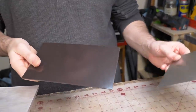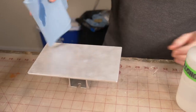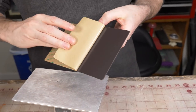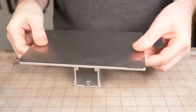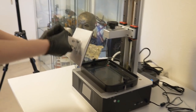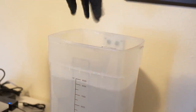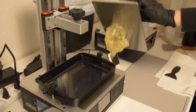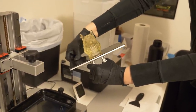To make our printing more streamlined with the resin printer, we picked up a flexible build plate. I cannot recommend this enough — it makes it so much easier and gentler to take resin prints off. It's just a steel sheet that's magneted to the build plate. The print gets attached while printing, and then when done, you pop it off, give it a little flex, and it falls right off into the vat of isopropyl alcohol. Previously I was chipping pieces off; now it's so much easier.